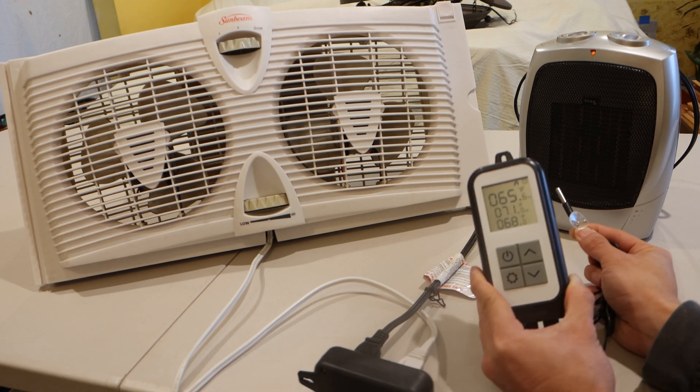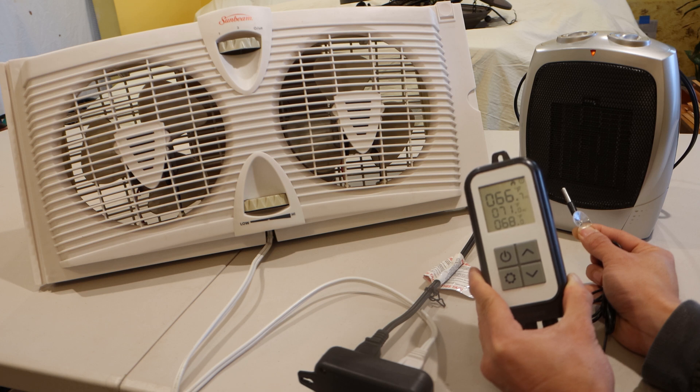Note that the lower limit only serves to trigger the on event for the heater, and it will continue to run the heating device until it comes within 3.5 degrees of the max temperature, which in this case is 67.5 degrees Fahrenheit. So now the heater is off.